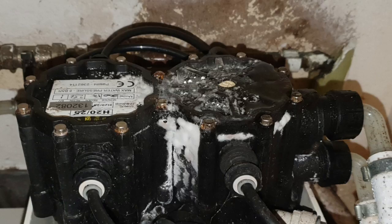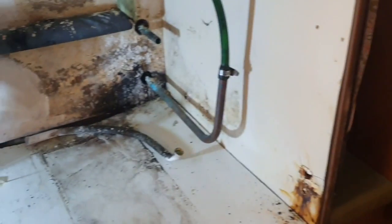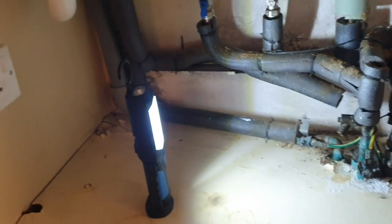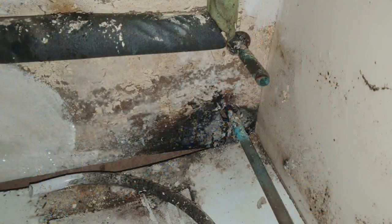This block salt softener has come to the end of its life and been leaking in multiple places — let's rip it out and inspect the damage it's caused. The majority of the damage is due to condensation. Condensation is a sign of continuous water usage or a leak somewhere in the property. Water droplets form on the exposed pipes and drip onto the base. These pipes were all covered with tiny droplets of water and mold has been growing.